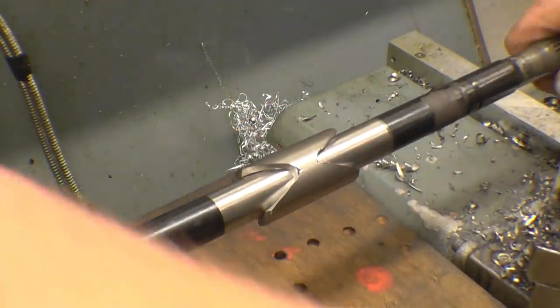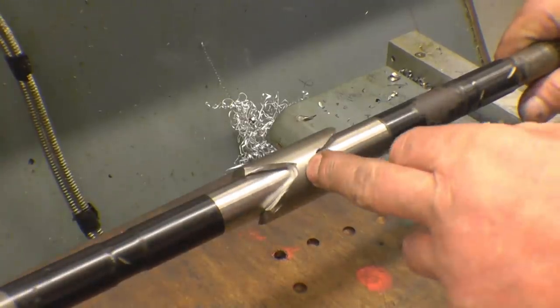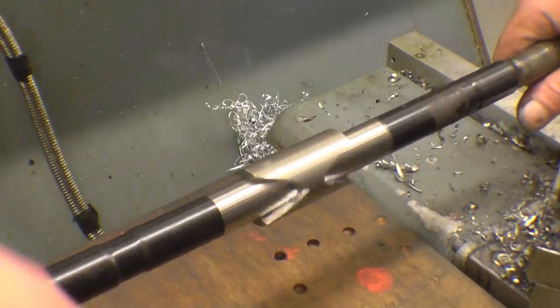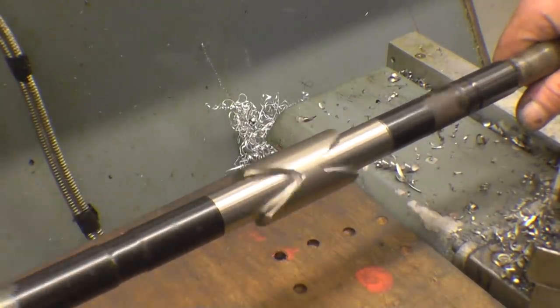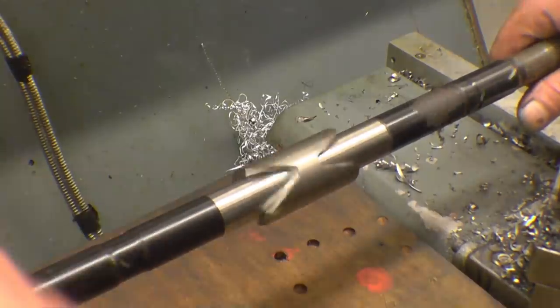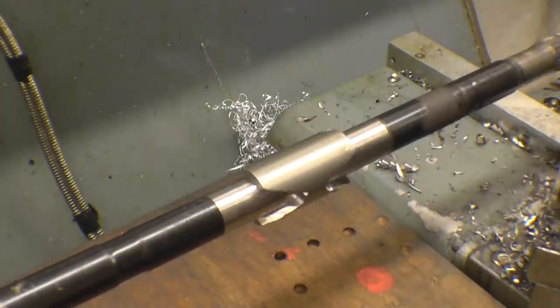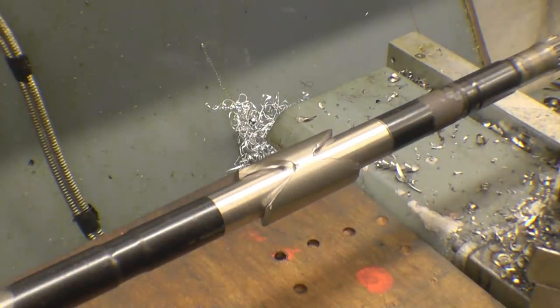Right, they're pushed in there together. The space in the middle is 10mm. I don't know where I got 25mm from. The shaft's 10mm longer than it was. It's obviously all he needs. It's running reasonably true, so what we're going to do, we'll tack it up in here and then keep turning it and make sure it's still nice and true.